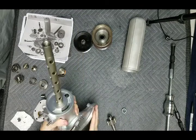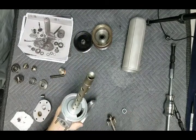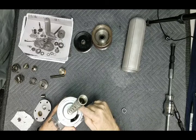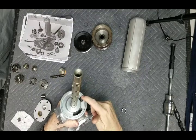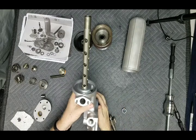So that's basically it. The oil filter is strictly that — an oil filter. So if it gets clogged, it's clogged. What you have is a spring-loaded bypass ball right here. If it indeed clogs up, this will open up and let the unfiltered oil through here to save your engine.